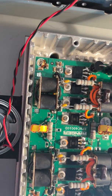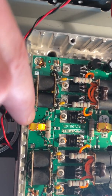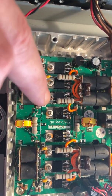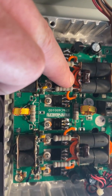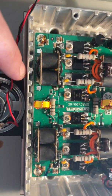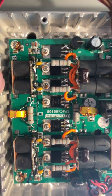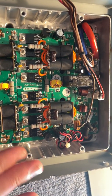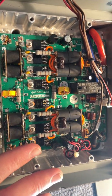This is how they have it wired. I know on a different style, like a Texas Star Dave Made style, the wires come out the other side, and it depends on the orientation. But this is how Ranger wired them up. So: output transformers, wires stay the same, 500 pF, remove the 1,000 pF, and two wraps on the input transformers. That basically tuned out the ERF2030s for this 2970 N2 amp section.